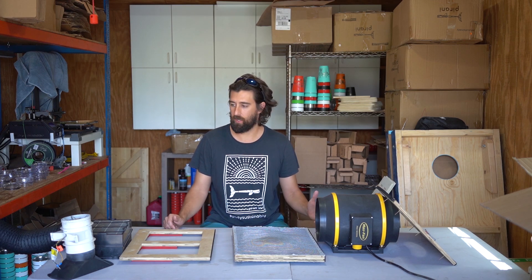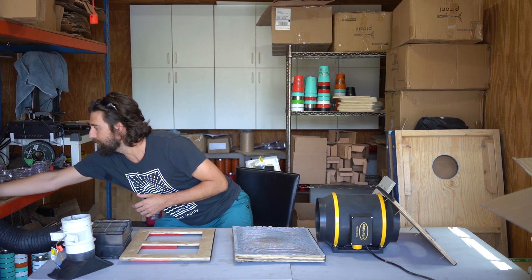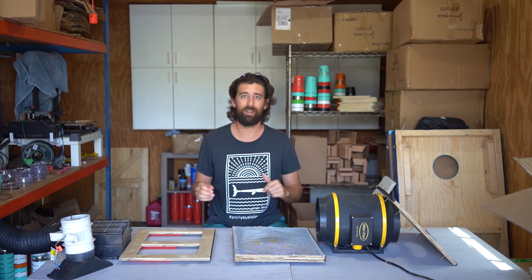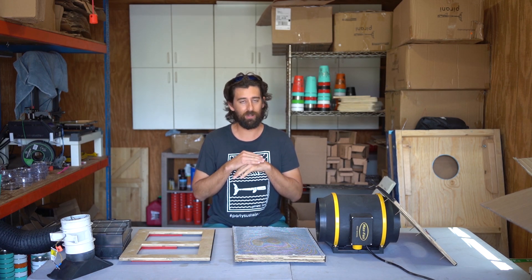When I first started, obviously you need to vent the smoke because what I do is laser engraving on powder coated metal — you have to get rid of the exhaust because it's really, really nasty. The first time I did it, I did not vent it out very properly, and almost within 10 or 15 minutes I got a headache and I shut the machine down immediately. So please do not do that.